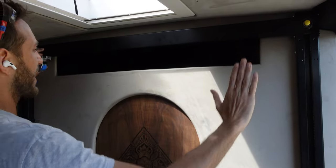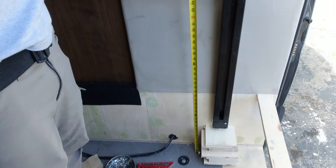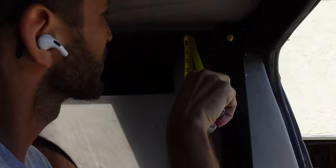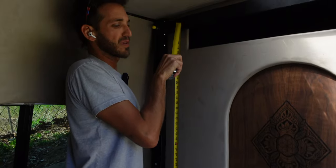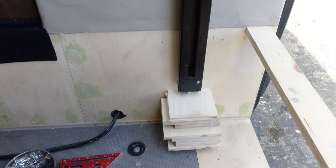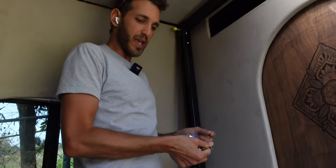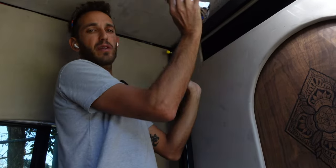The next thing is to make sure it's not angled in any way and sitting flush. I measured from the floor to one of the cross beams — it was 70 and three-quarters on both sides, so they matched. What I did is make stacks of wood exactly the same height on the bottoms so I don't have to hold it in place while screwing it in and can get it really exact. One side was about an eighth of an inch lower, so I added a little eighth-inch piece of wood and now it's exactly flush and straight.